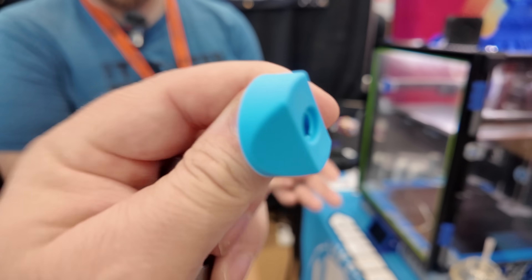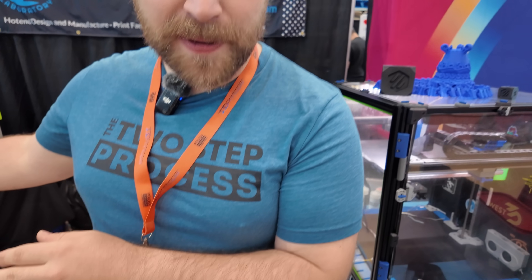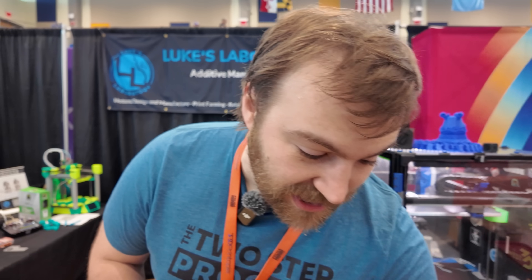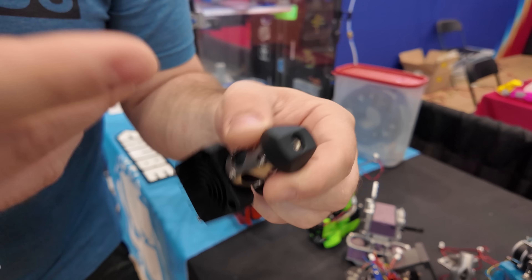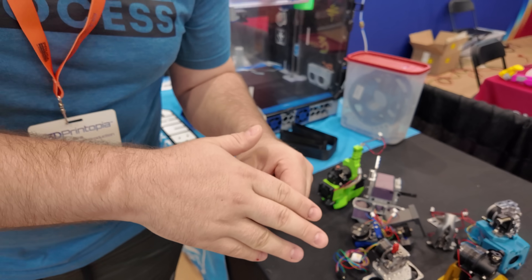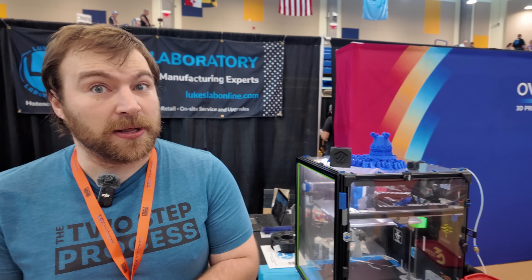It's got a booty — a sock, yes. This is the same high-temperature sock we're speccing for the Pika. It'll be good to 300°C continuous, functionally continuous. It fits right over the end of it. You can install it with or without a nozzle — we made the geometry special, meaning we just tried really hard. You can install your nozzle separately or install the sock with the nozzle on for ease of use. It has great grip and should survive a very long time.